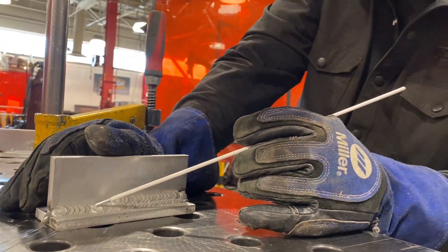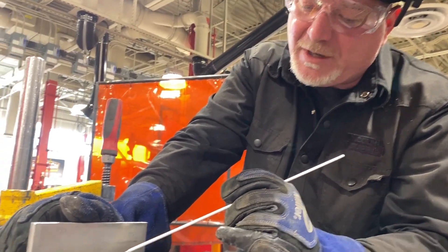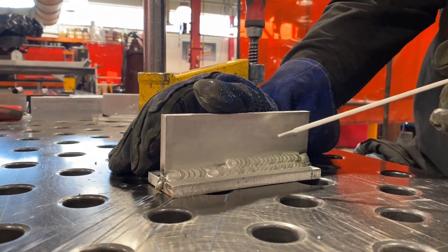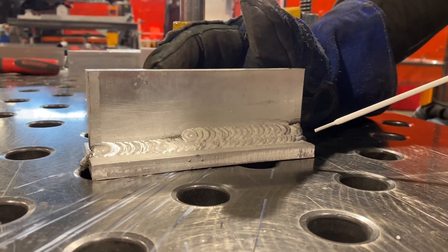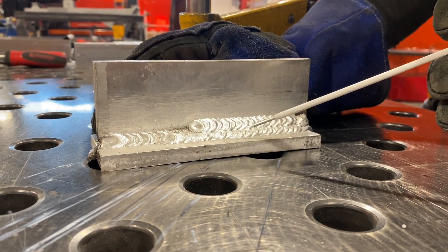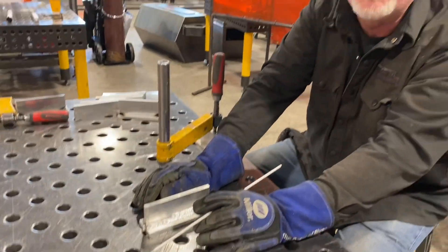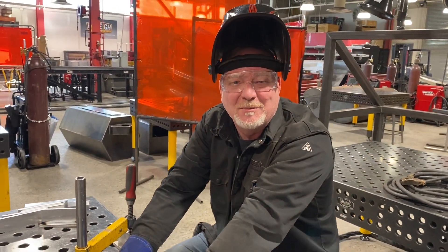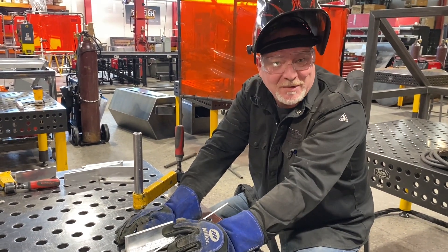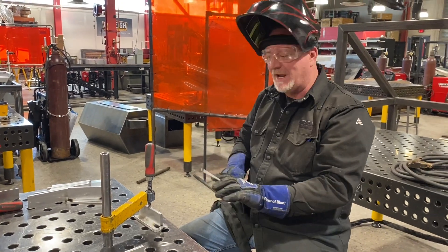So the second pass covers the first one about two thirds, and then the third one fills right in exactly where it should go. And that is called a multi-pass pulsed aluminum MIG weld on some 3/8 inch thick. Another problem a lot of us have with thick aluminum is the thermal conductivity of aluminum is really bad, so it gets rid of heat fast. You've got to have a pretty big TIG welder to weld 3/8 inch aluminum — another advantage of MIG welding.